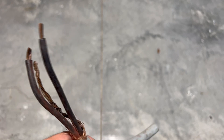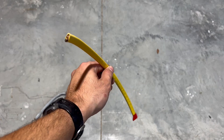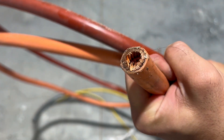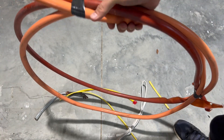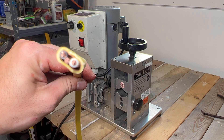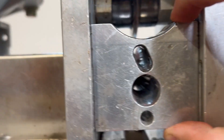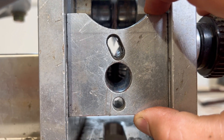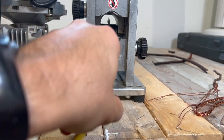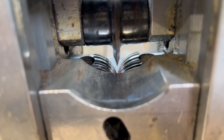This was the first time that I ever used it, so I started off just grabbing some random wire — some Romex, which is something that a lot of people have access to, and then some of this really large stuff that I used a couple videos back with my smaller Stripmeister. I decided to start out with the Romex wire. The first thing I do is get the holes lined up on the appropriate size I want to use, make sure it's nicely lined up with the blade, feed it in correctly, and get the blade set to the right depth.